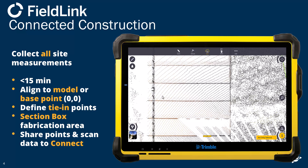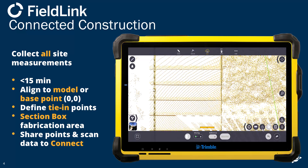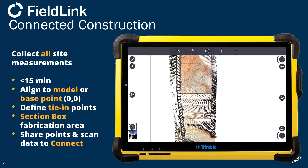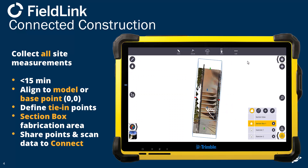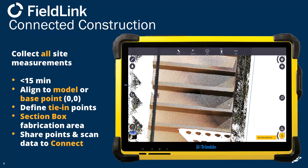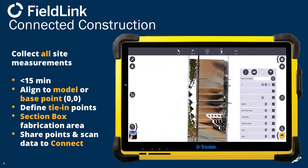I can see this is where my second stanchion is. I can actually come in and create a point where that lives. Life becomes a lot easier if I do that, because then I have something in Tekla that I can pull to. There's my second stanchion, and I can drop in another point. I'll drop points on all elevations that allow me to pull off of them. I'll have a bunch of measurements like this, as well as where my stanchions are. Within Tekla, I could trace the point cloud, but it's generally a little bit easier to have starting points.